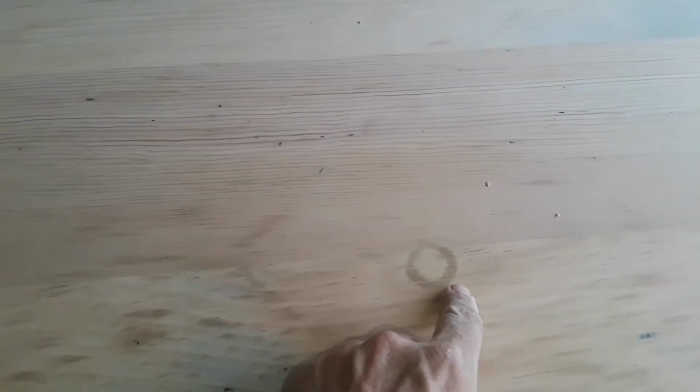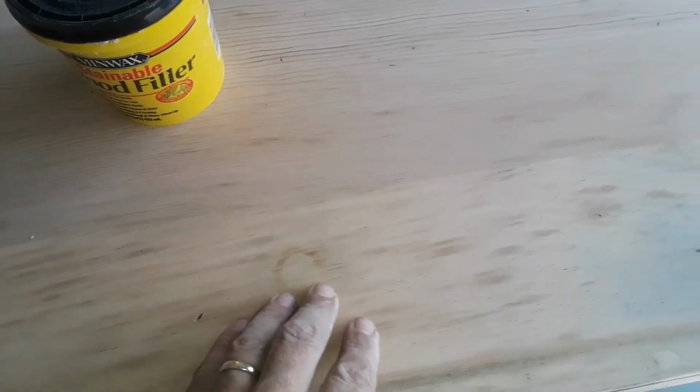And these spots here are still here. I don't know what they're from, and I've sanded it down a little bit, and I'm going to take the fine sandpaper again just to run over the top again before I finish up sanding, because I'm going to clean my entire garage. Then I'm going to wipe this down with a damp tack cloth and get it ready for staining.